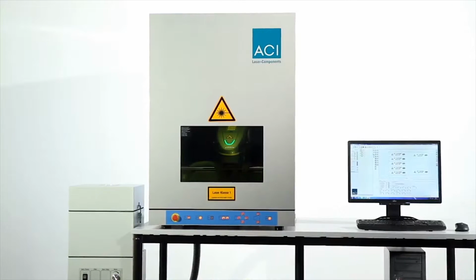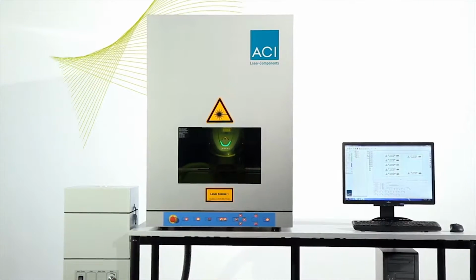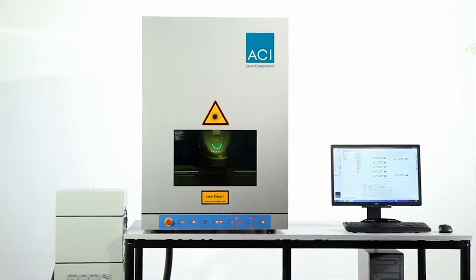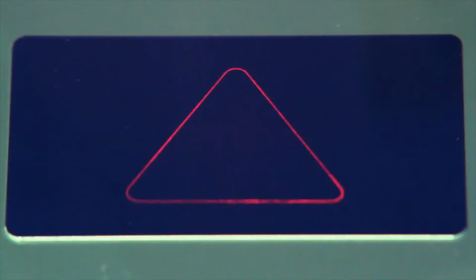Two visible red line lasers are integrated in the system for rapidly and simply focusing parts with different heights. This function can be very helpful to achieve the correct focal height if parts are changed frequently. A preview function enables operators to position parts in the workstation quickly and efficiently.